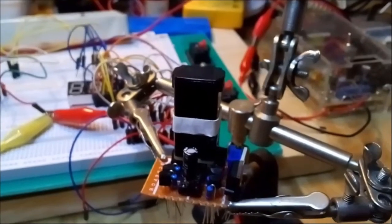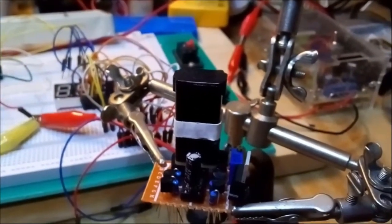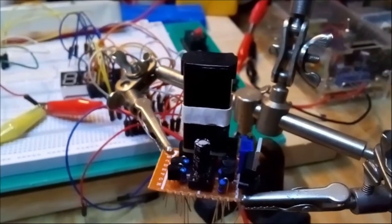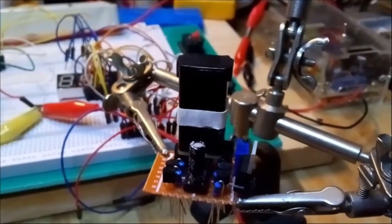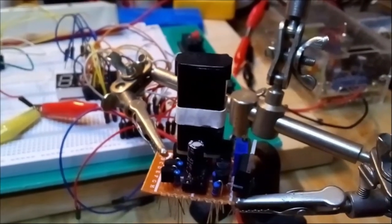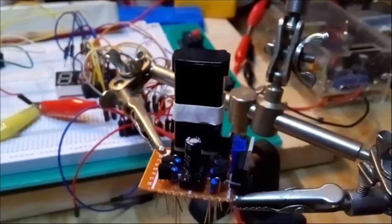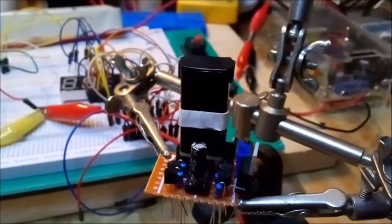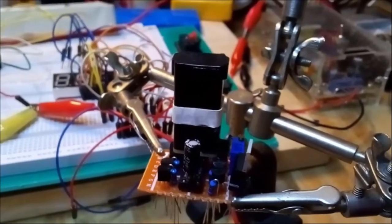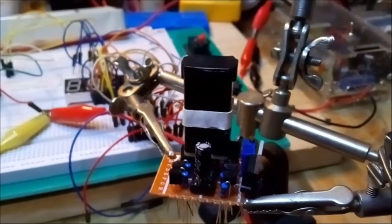Yeah. Also, I have the habit to build stuff as small, as compact as possible, for a number of reasons. The very first reason is that the shorter the path electrons have to travel between components, the less likely it is that I'll induce unwanted, say, noise into a design, okay? So the shorter the leads, and certainly when you're building something which is high frequency, the better it'll work. Secondly, of course, the more compact I make something, the easier it is to use afterward or to build in to something.